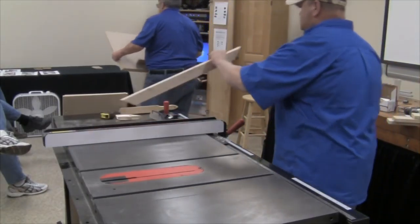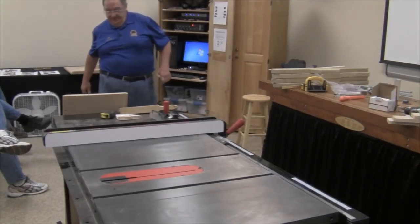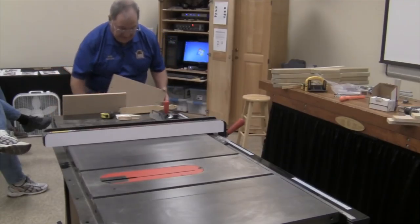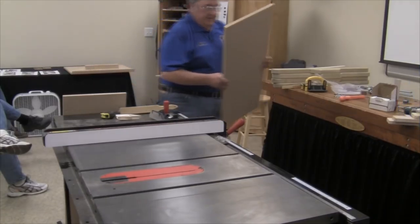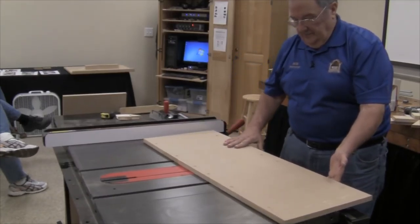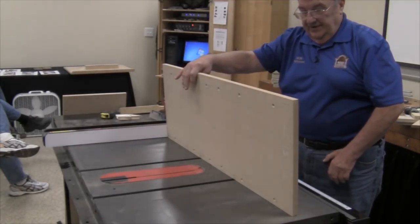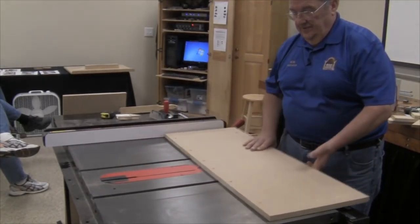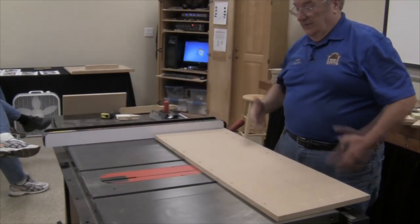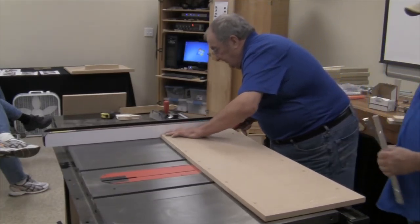So we'll go to this side and do a similar operation on this flat 45. Okay, this one here is 40 inches long, as opposed to the other one being 30, just simply because the bulk of your material is going to be sticking out the one side, as opposed to the standing 45, because the material is going to be resting at a 45-degree angle.